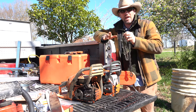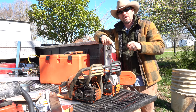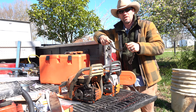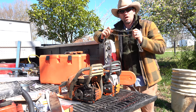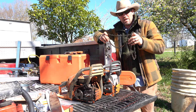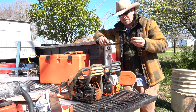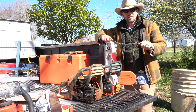On that note: I've read on a lot of forums about people taking a .325 chain and throwing it on a 3/8 sprocket saying it works fine — you are ruining your chainsaw and that drive sprocket. Don't do that. If you've got a .325, use .325. If you've got a 3/8, use 3/8. It's that simple, and you can get the chain you need in either pitch.